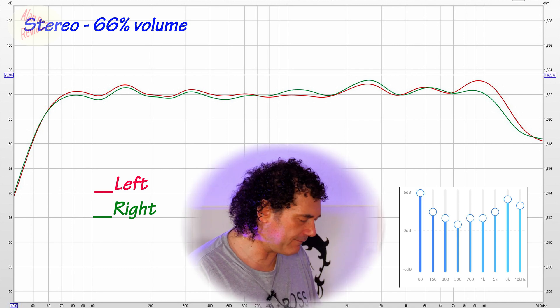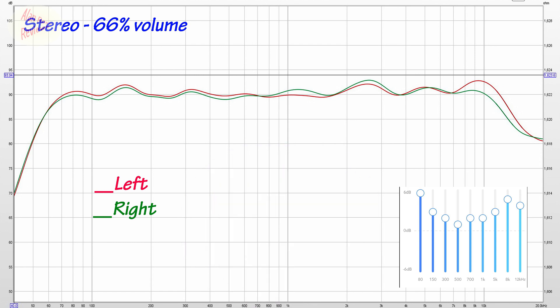As you can see they are both in custom mode - woohoo, they have finally fixed that bug, been waiting since day one! You will notice the left speaker has a little bit more high end than the right hand speaker. After I had them linked and I turned them off and then turned them back on again, the right speaker EQ at the high end had slipped by a decibel. The sliders do tend to do that, they do move around a little bit, so it's still something you'll have to watch. Basically still in custom mode, but yes - the last three sliders slipped by one decibel, you do have to get them in just the right place or they will start moving around.